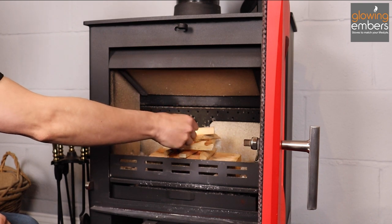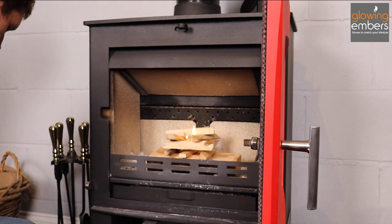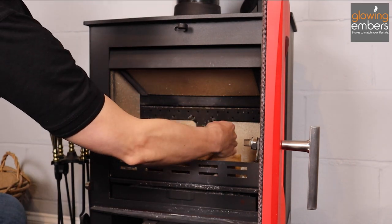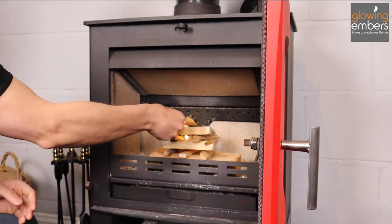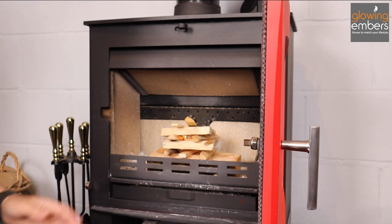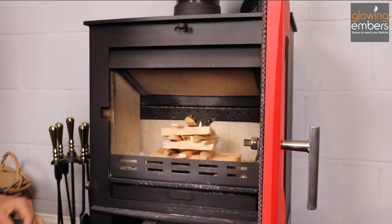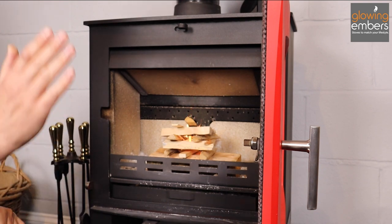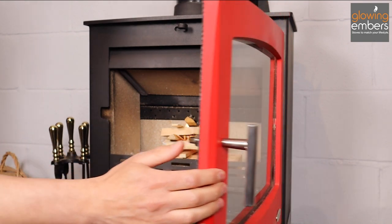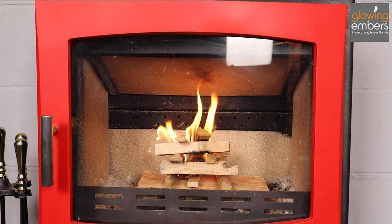Once that's nicely lit — I'll leave that match in there to burn as well — put a couple more bits of kindling on top and then we're just waiting for the fire lighter to catch the kindling. What that will do is burn upward, sending all that heat straight into the flue system, and as more catches fire it'll burn down into the log and the log will finally catch fire. Always leave the door open at least a crack while this is going to get as much oxygen in, and once the fire is fully going you can put another couple of small logs on and then close the door.